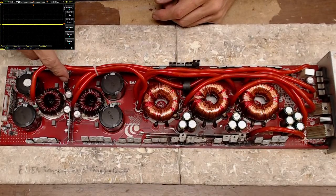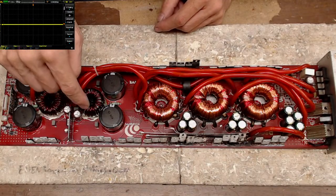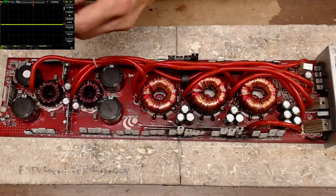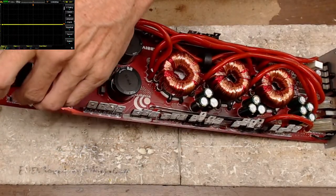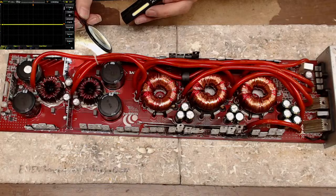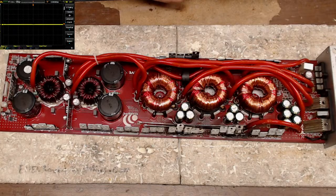They took the opto couplers and moved them external, onto daughter boards, and they took the gate drive transistors. I don't even know if this uses the T2 or the 1X and 2X. Let me see what ones they use here. They use 2T. Wow. Of course, I'm blind. They use the 2X and 2T transistors for the gates of those 640Ns. So this is really just a different layout of the same thing.